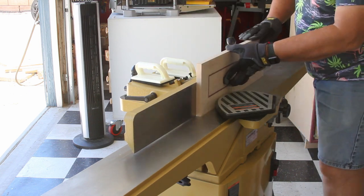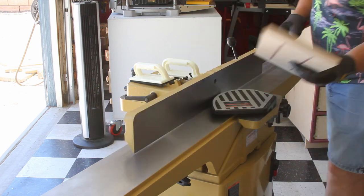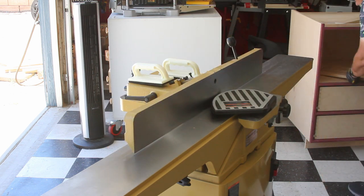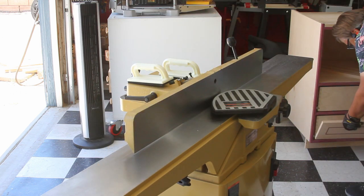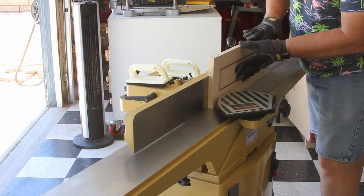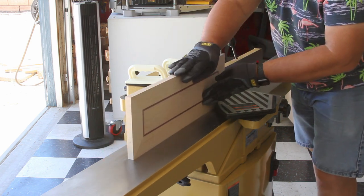Once the drawers are finish sanded, I take and size them up to each of the openings using my joiner. I take a very minute cut - about a 64th of an inch - and you want to make sure you go around to all the edges on every single cut. Every time you reduce it down, go all the way around, otherwise the very corners are going to be off at the glue line. I fit it to the front of the drawer opening to check, then keep cutting until the drawers fit perfectly. No matter how well you do everything, your openings are going to be just a slight bit off from each other, and this method makes your drawer fronts fit very precisely with a nice, clean, even line all the way around.